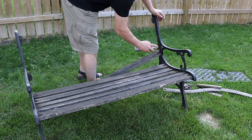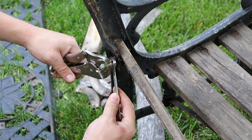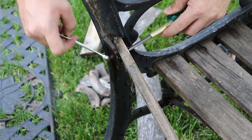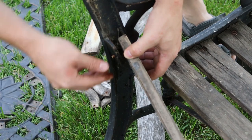If you come across bolts that are completely rusted together — nuts and bolts just welded solid — you might have to bust out the penetrating oil like I did. Give them a good coat, let it soak in for a good long time and they should back off. If not, you might have to resort to more drastic measures.